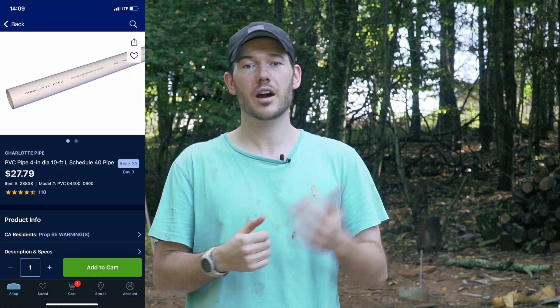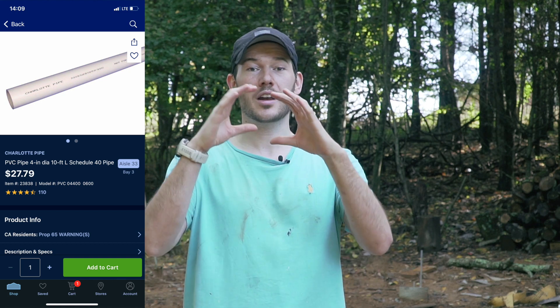So which one should you use? The answer is you should use the DWV Schedule 40, which is the stronger kind. It is slightly bigger — it has a larger outside diameter than the others, and it will require the same DWV-approved fittings, which are more expensive, probably twice the price of the other 4-inch PVC fittings. But you probably want your sewer line to last as long as possible, so there's no doubt this is a sound investment.